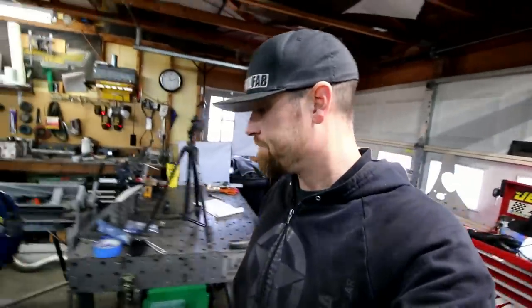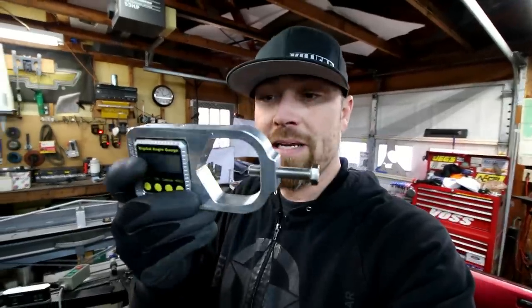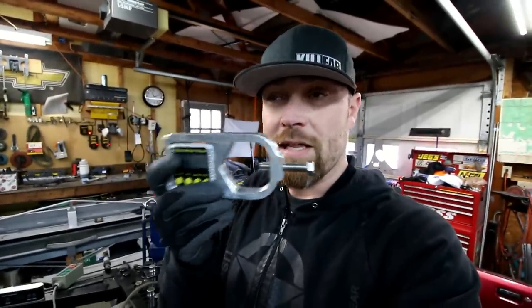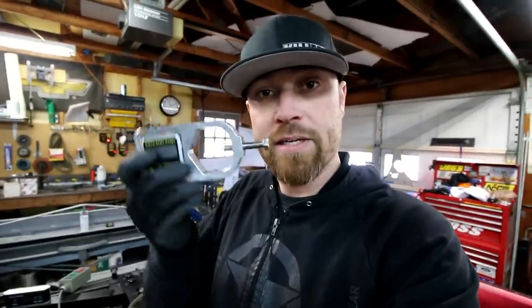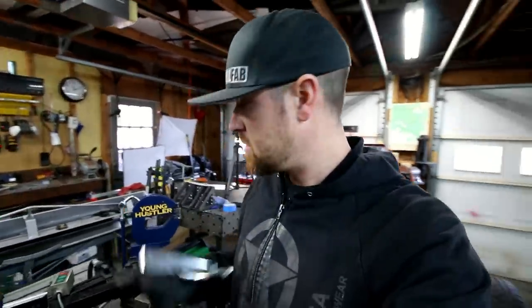The way that I do that is I just use one of these rotational gauges. So as I slide the bar in on the first bend, I'll put this on the bar, I'll zero it out, and then when I pull that thing out of the bender and I put it in the other side, I just want to make sure that I re-zero the degree of clock on that bar before I bend the second bend. Pretty simple. Hope I haven't lost you.